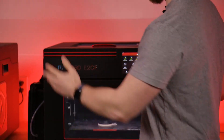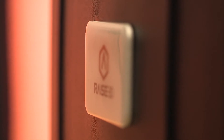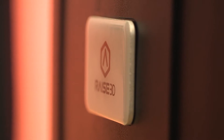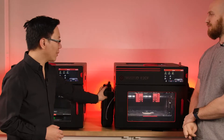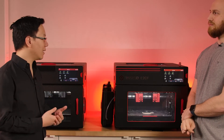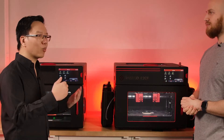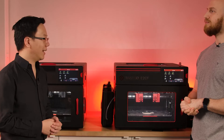Let's start with the differences that are apparent right away — what are those boxes for? The boxes are for the nylon carbon fiber. As you know, nylon is very hygroscopic so it will absorb atmospheric moisture. The dry box ensures that the material stays in a consistent condition so that when we use it, the printing material properties are within spec and within our expectations.